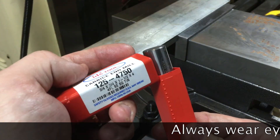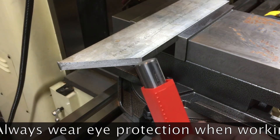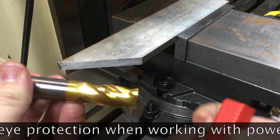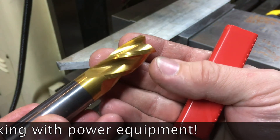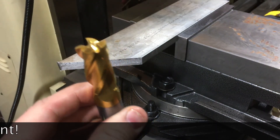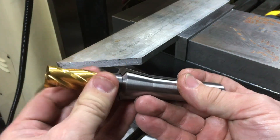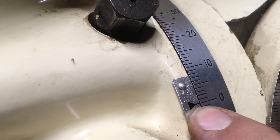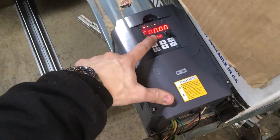Not-so-common-sense reminder: safety glasses on. For this purpose, the larger the diameter of the mill the better. I start with a three-quarter inch square end mill. Later in the video I'll be using a fly cutter, and it makes an awesome looking surface finish. At the beginning I set the mill head to the factory zero marks and start the mill.